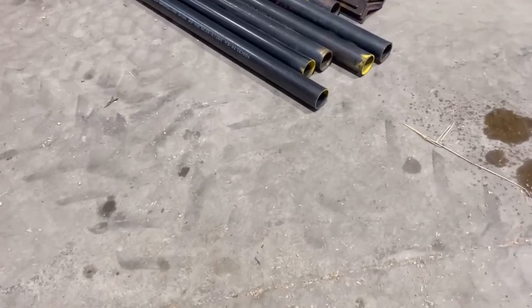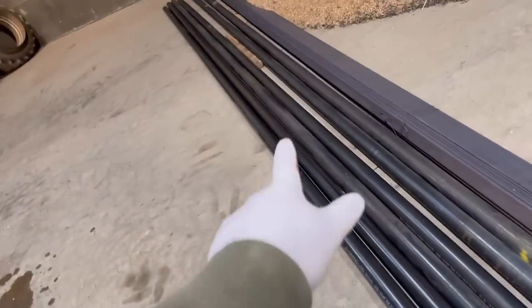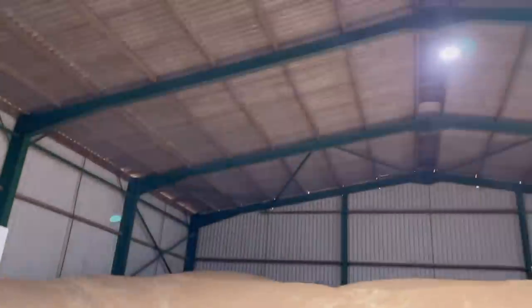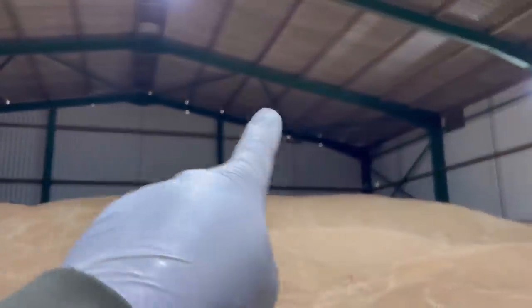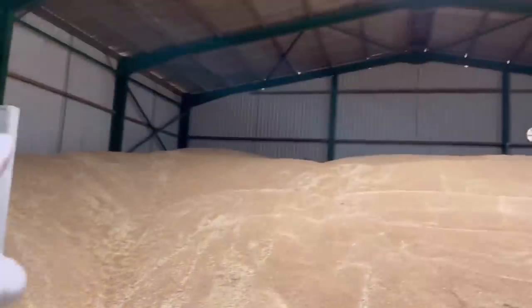Right, some of the steel started to arrive. So these tubular lengths here are the wind bracing. So you see up there, 1, 2, 3, 4, 5, 6. So we've got 6 of them. And then we'll have 2 that go in the side as well, like that, to support. You only support the first bay of wind bracing, so it stiffens the whole thing up.